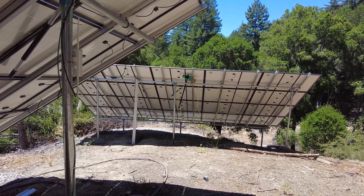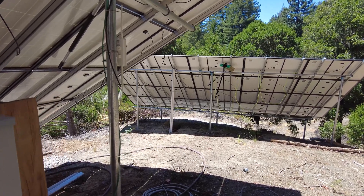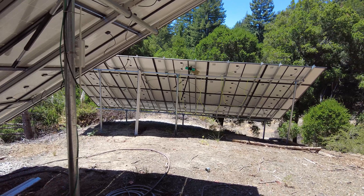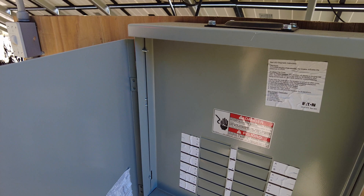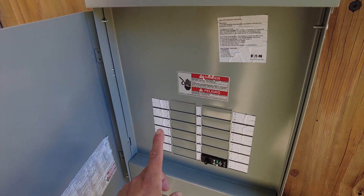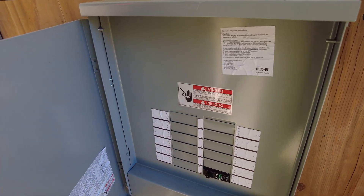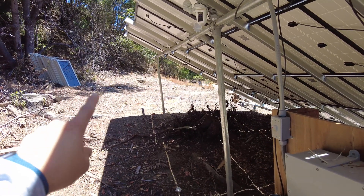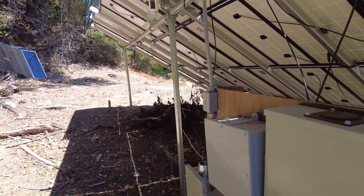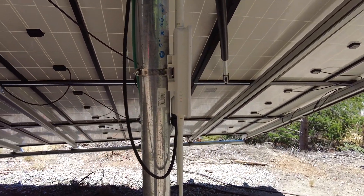Those extra 10 panels are going to go on micro-inverters on the AC side of things, so everything down here is DC all the way to the inverter shed. We may install some additional panels on the AC side as well. We have these outdoor breaker panels every 200 feet on the property. While we were trenching for the DC side, we also ran AC — two-gauge copper all the way through — with breakers, so we can feed power to the system on the AC side as well.